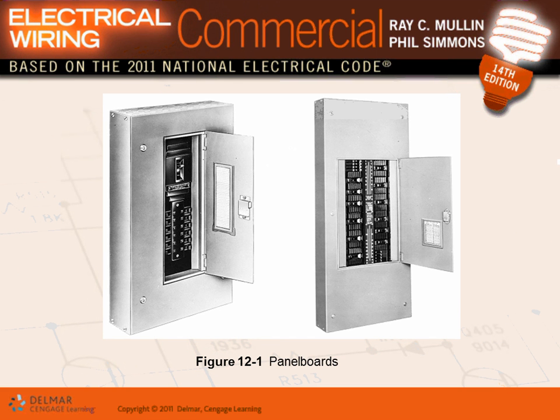Here's how panelboards look like. You're looking at it, gentlemen: main lugs only. You're looking at main circuit breaker. Guys, when you start the next project, and this project, Karen, when you start dropping your panels and you go to Revit, you're going to see MCB and MLO. So you need to understand: do I need a main lugs only, meaning no circuit breaker, or don't I?